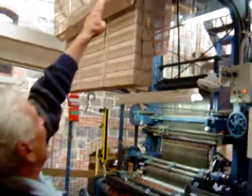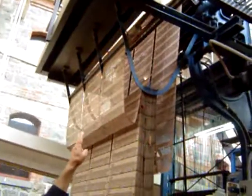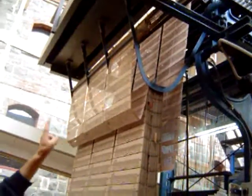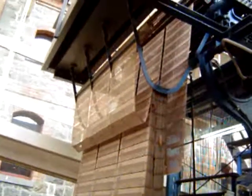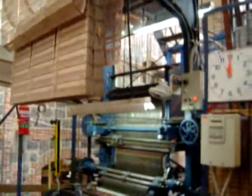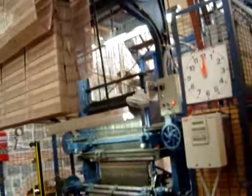It's magic. Up the top, you see how my pattern cards go over and down behind that brass cylinder. Now, it is a square, but we call it a cylinder, and it's been drilled with many, many hundreds of holes. Can you pick that cylinder up then? Great. It's called the Jacquard, after our famous Frenchman. What it does, takes in on its face three cards at a time. That will select for me one row for our card.